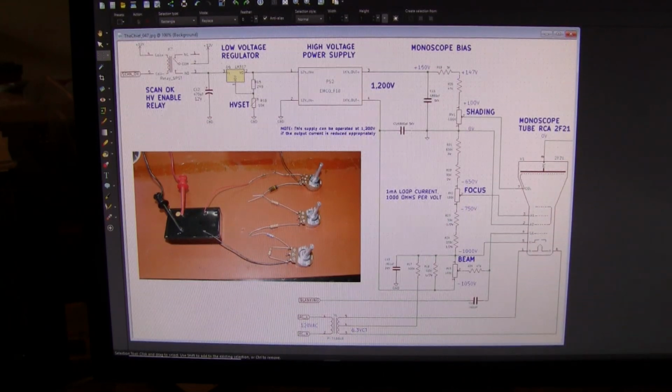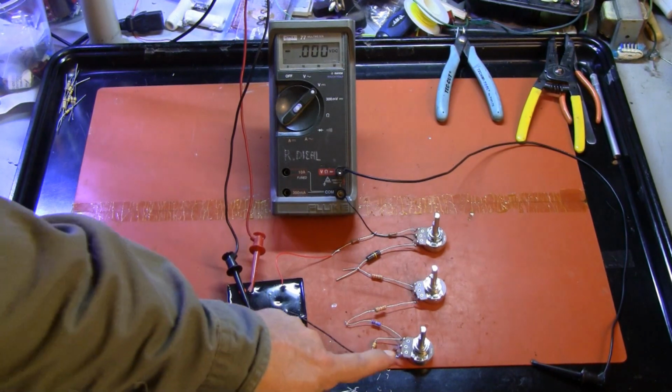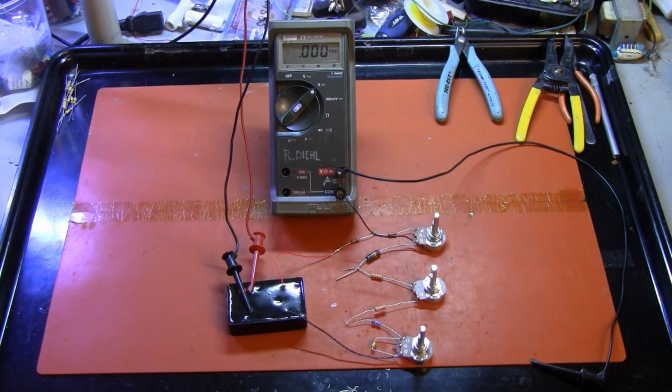So, at this point, let's move over to the workbench and look at the actual circuit. Here we see the physical implementation of the circuit we were looking at on the schematic. I would like to correct one error I made in the description. The beam control has a 100K resistor paralleled with it because we need a 50 volt drop there. By paralleling 100K fixed with my 100K pot, we get a 50K pot, giving us the required 50 volt drop.